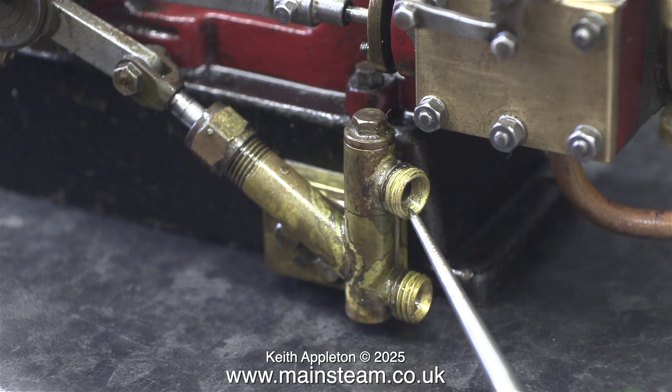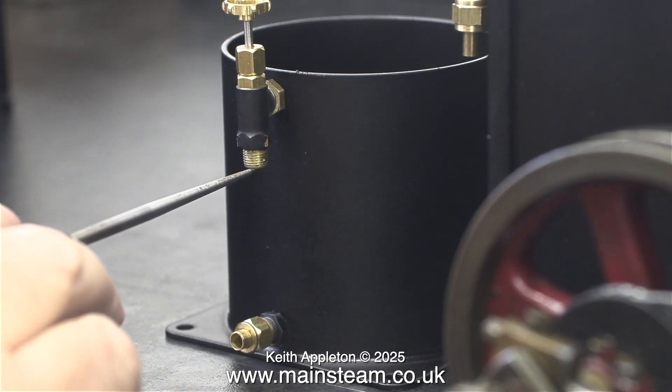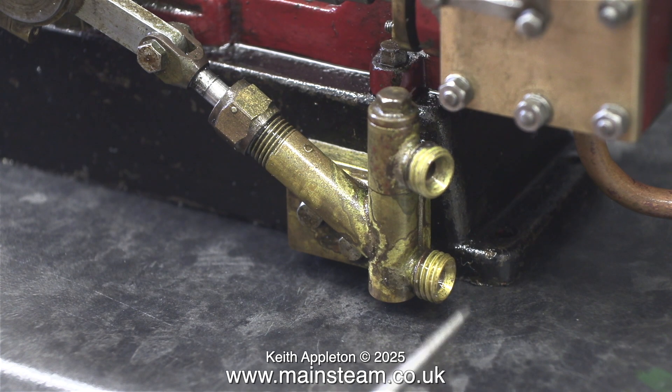The threads on the water pump are quite coarse, but luckily with the engine came a T-piece and some piping. I can't reuse the piping but I can reuse the T-piece. The thread on the bypass valve is quarter by 40 threads per inch, so all I have to do is silver solder a union on the end of that pipe which has a quarter by 40 union nut. Here I'm pointing at the quarter by 40 threads — you can see they're a lot finer. Here's the water inlet, which will take a 5/32-inch diameter pipe, just the same as the bypass valve and the piping from the T-piece to the check valve on the boiler.